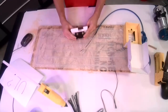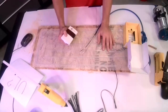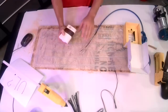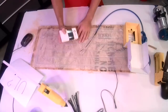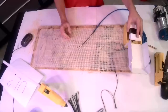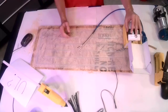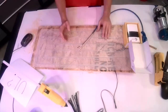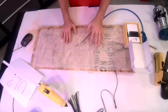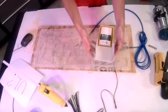The other thing is floor heat does need to be on a dedicated breaker per national code. It does not need to be one breaker per mat, but the heating itself does need to be on a separate breaker. So in a tiny home, you likely will end up with probably one 20 amp breaker that would feed 1 to 2 controllers, which would be the most common installation. You can do a separate breaker per thermostat if you want, but at a minimum, it needs to be on its own dedicated breaker for the floor heat itself.